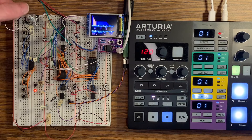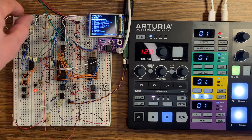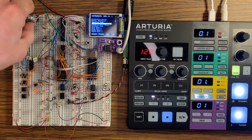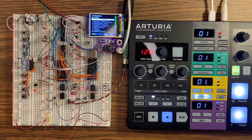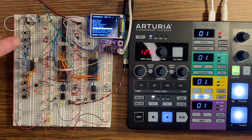If you don't want to set everything up manually, you can select from a set of different patches. Each of the 16 MIDI channels is assigned to a different instrument. When a note comes in through MIDI, it chooses that instrument, loads it into the chip, and plays the note — so I can set instruments for each channel independently. For example, I can flip through all the different options and select something like an electric guitar, and that becomes the assigned instrument. There's also an option to turn preview off so you can browse and select silently without hearing changes.